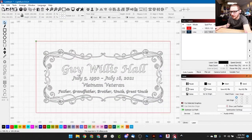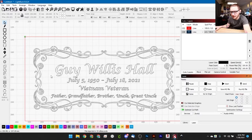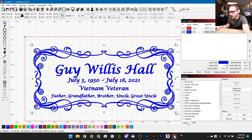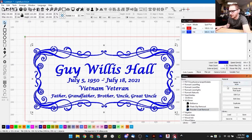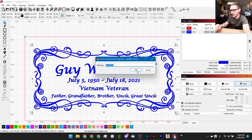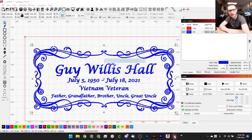We'll paint this blue so we get a nice fill on it. For settings, I'm thinking we're going to use our powder coat removal setting for tumblers on the ammo can, because the ammo can has some thick paint on it. This tumbler setting should get through that paint. We've got 30 power on a 100-watt machine — that should chew right through it. We'll start the job in the top left corner, frame it a couple of times to make sure everything is relatively centered, then shoot this over to the CO2.